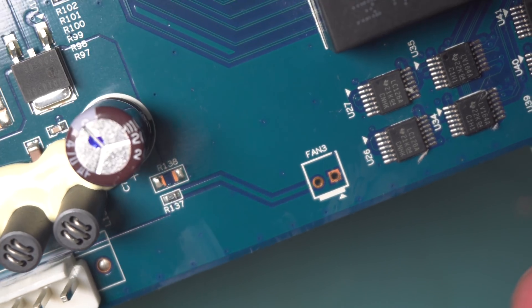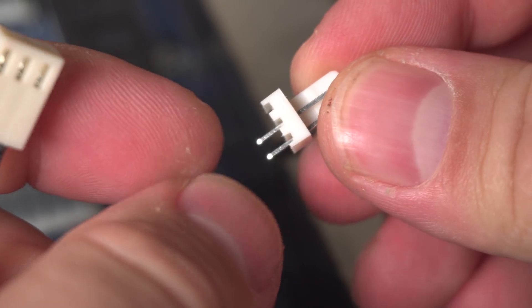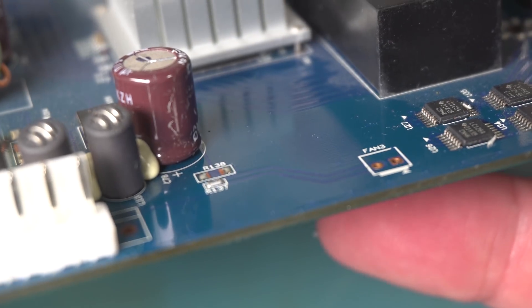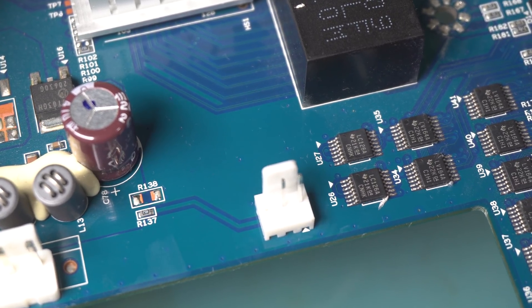Using a flat tip, I mixed in a little bit of leaded solder to make things a bit easier, and it came right off. I'm using a standard 3-pin header for a computer fan with the yellow tachometer pin pulled out, since there are only two connections needed. The mark is ground. That soldered pretty easily. This might only be a 2-layer board, which would explain how they're keeping the cost so low.